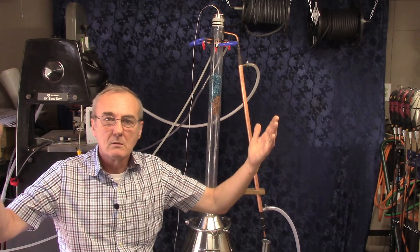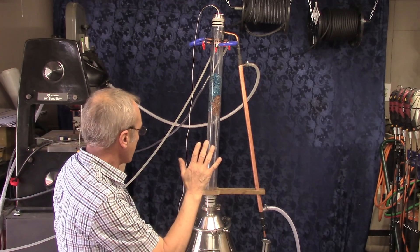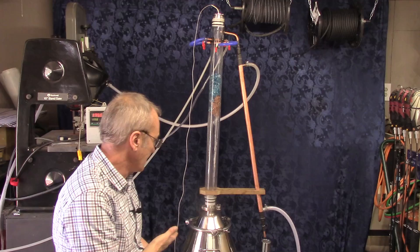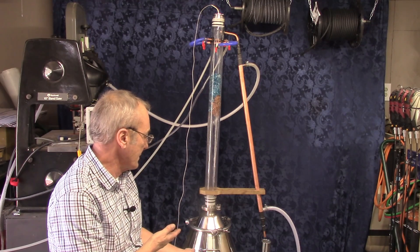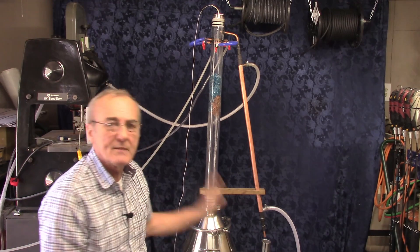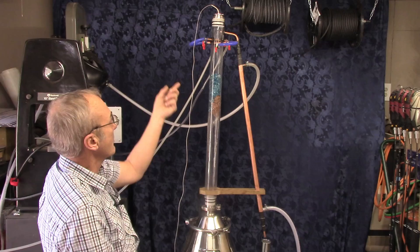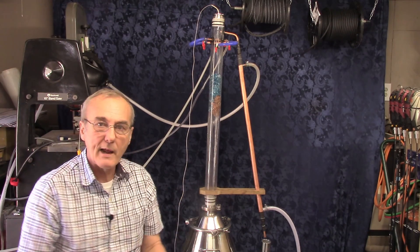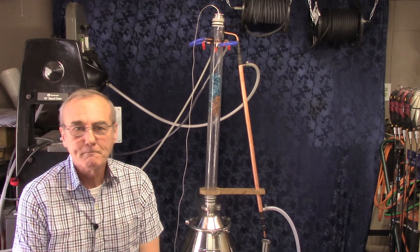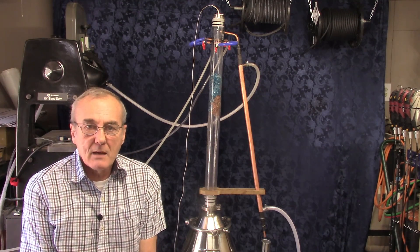So what do I do now? Now that I've got it set and it's running, everything looks like it's going well. My output is just a constant drip. I don't have my spurt yet — I could turn it up a little bit, but I'm kind of happy with it, so I'm going to leave it running. All I've got to do now is sit back — temperatures are balanced, water flow is balanced, my condenser is working. Every once in a while I need to check the temperature, which is now 53 degrees in my cooler. If that gets up to about 60 I'll turn the air conditioner back on. I've got time now to clean up the shop.